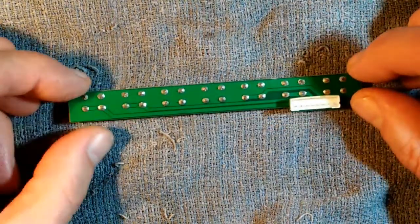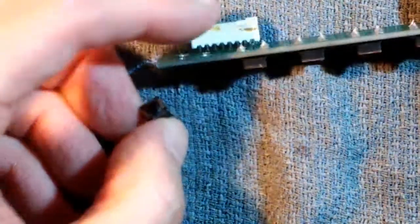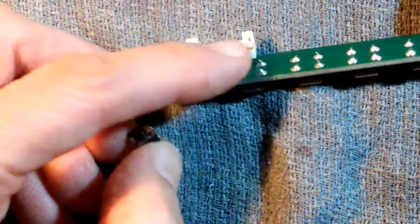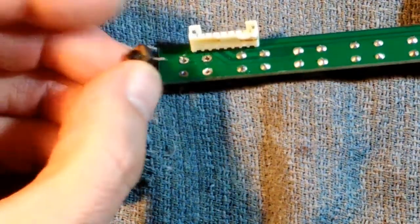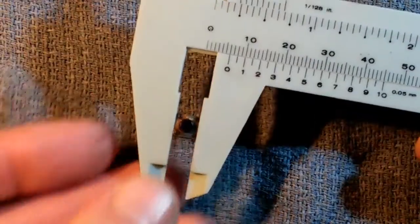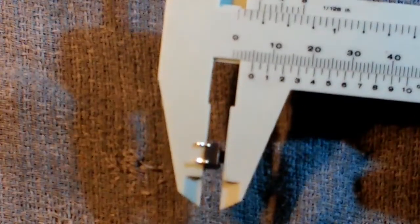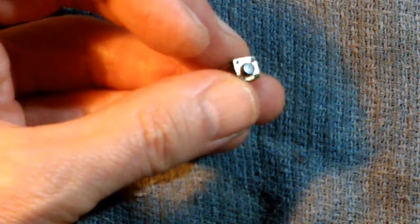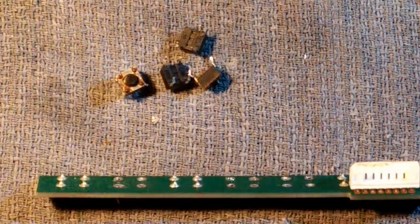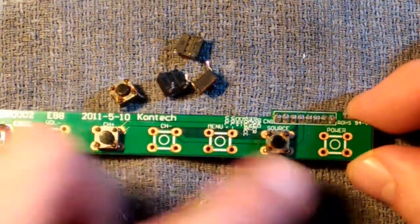It's going to take some soldering and desoldering skills to do this, so you're going to need a soldering iron and some knowledge of how to use it. If you go to eBay and search for 6x6x5mm 4-pin, you'll come up with dozens of vendors selling these switches. I've gone ahead and desoldered the first switch. Be careful working around the plastic connector because you can easily damage that — with just a slip of the soldering iron you can melt it pretty fast. I'm going to use a plastic micrometer to measure the size of the switch: six millimeters by six millimeters by five millimeters. So when you order these, you need to order a 6x6x5mm momentary switch with four pins and flat mount. I've completed removing four buttons: volume down, channel down, menu, and power.